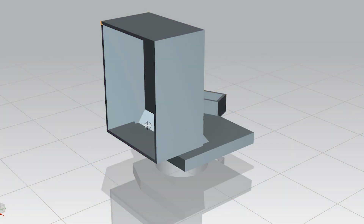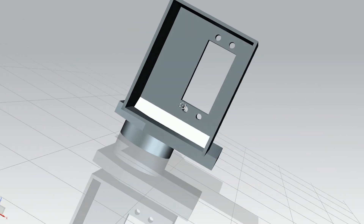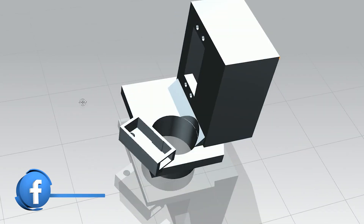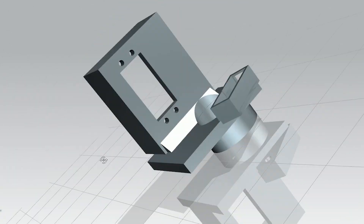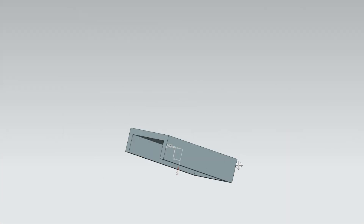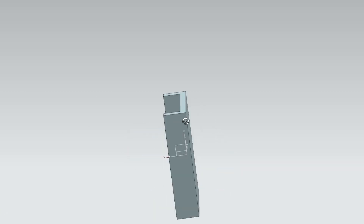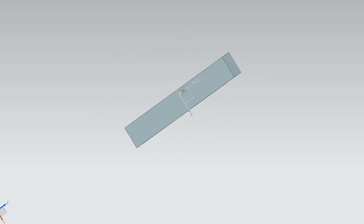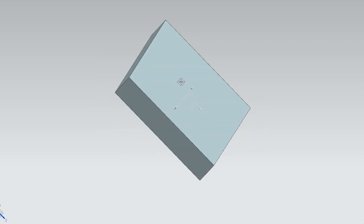The first thing I did was take the dimensions of the hand wash I had and built a CAD model around it. This CAD model has a servo motor block that holds a servo motor and a block where the IR sensor sits. There is also a cover for the IR sensor so that if there is any spill of water, it should not go into the electronics. And there is a cover which covers the servo motor block where the electronics and the microcontroller sit inside.